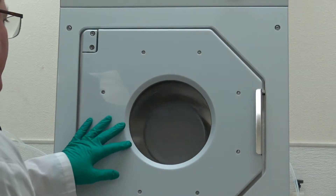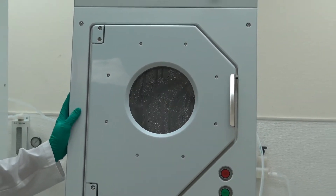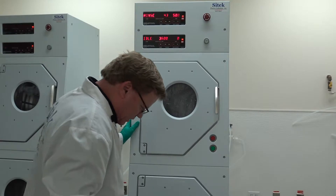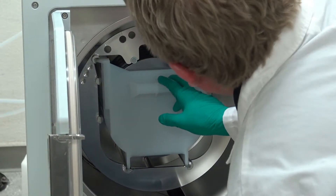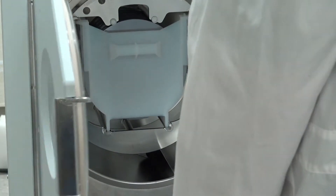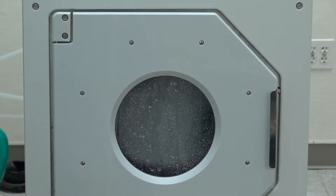As you can see, we're going into the process — let me show you the water's turned on. I have each tool facilitated separately because these use a lot of nitrogen, and having them both on at the same time would strain our system. Now we're in the rinse. Let me open the bottom system door. This is for the Integrus A200-MG cassette — that's 8-inch, 200-millimeter. I'll close the door and hit start. You can see the DI rinsing.